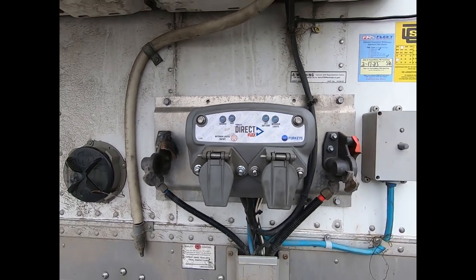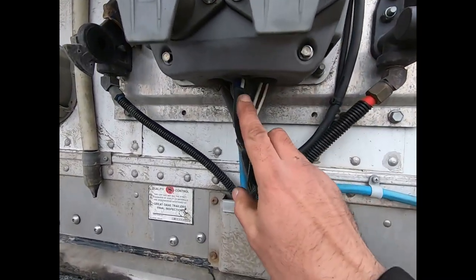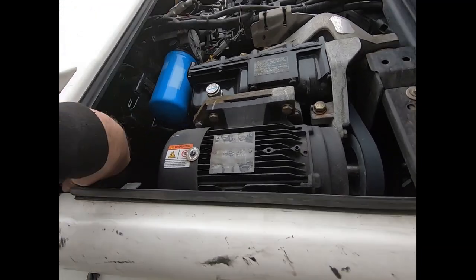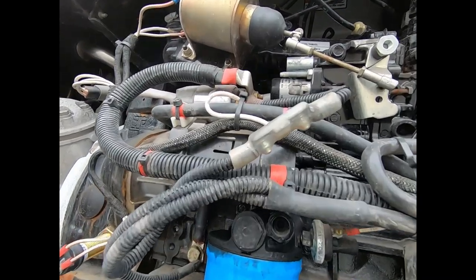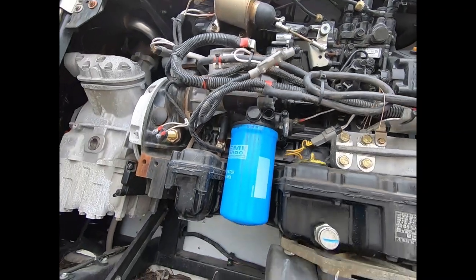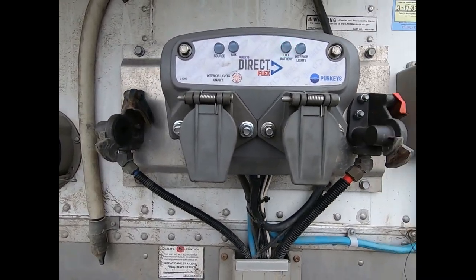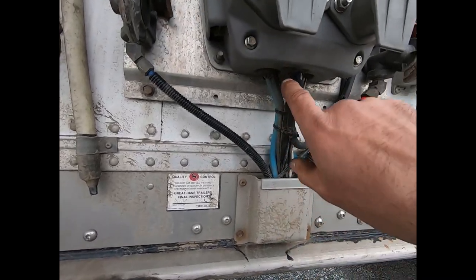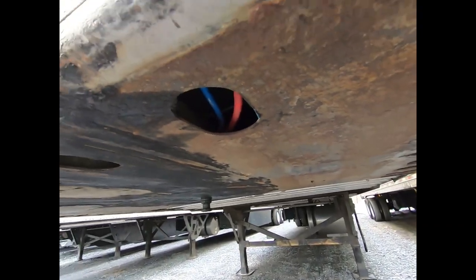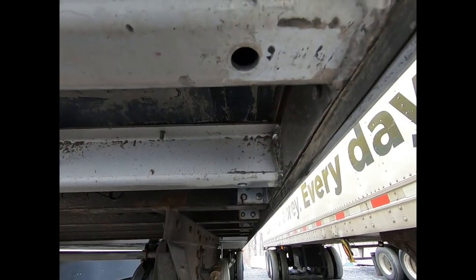Now we're going to check the wiring coming from the reefer. The voltage from the reefer going to the charging unit travels through this harness — two wires, a blue one and a white one. Those wires are typically hooked up straight to the battery or from the starter. There's a 30-amp breaker here — if you're not getting any reefer battery charging voltage, check that 30-amp fuse. Check the wiring coming down; you don't have to cut wire ties and go nuts, just make sure there's nothing rubbing or any wires chafed. Then we'll chase out the charging harness going to the battery box.